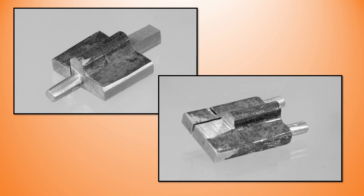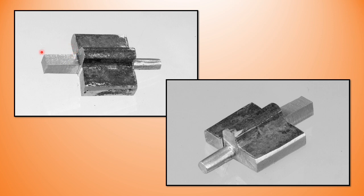For the single tenon, if you've got a much wider bead, then it's the same sort of thing. You're just going to cut to get rid of the bead, then cut the edges out, and that's going to leave you with this chunk of material. You're going to file that chunk to a square section. Here we go, we're filing to a square section, and then eventually, obviously, you're just going to take that to as big a round as you can possibly get.